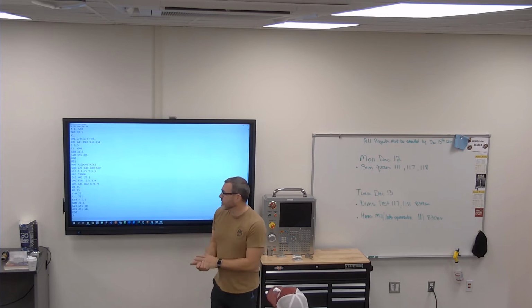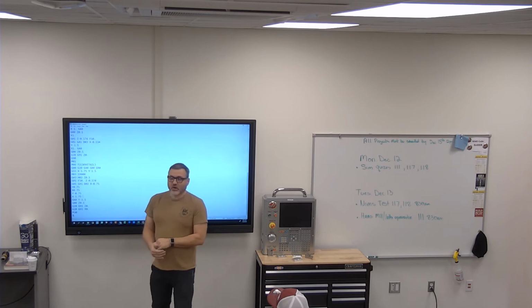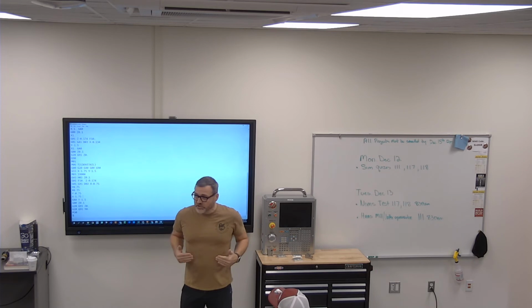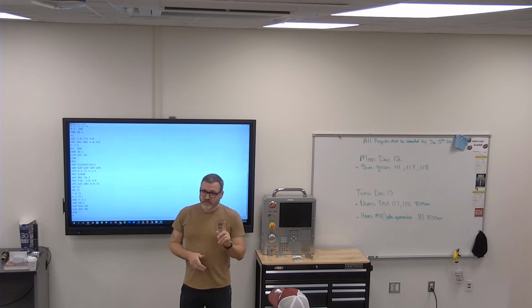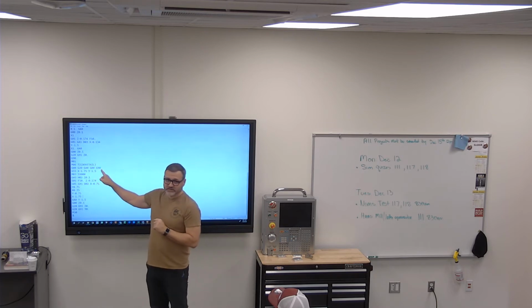If you'll notice on this program, I have failed to put a G90 in there. At the end of the program, the spindle goes up and the table comes towards you. Those are individual lines: Z up, Y forward. But there's no G90 after that, so the program ends in incremental. If you stopped that program and Jacob came behind you and started his program, he would be running in incremental. But there's no way he did not put a G90 in his startup line. That'd be foolish.